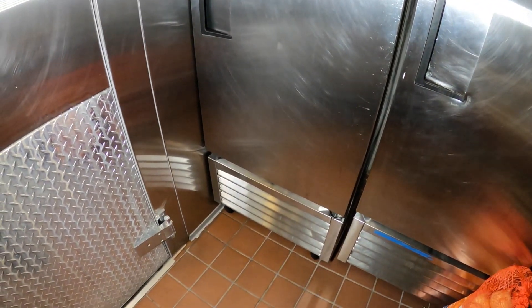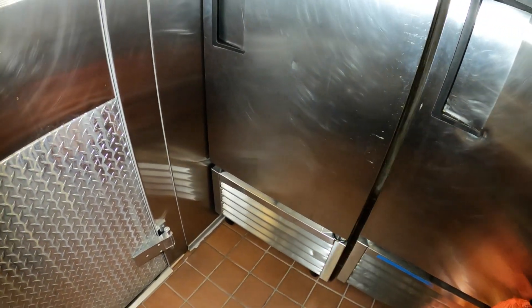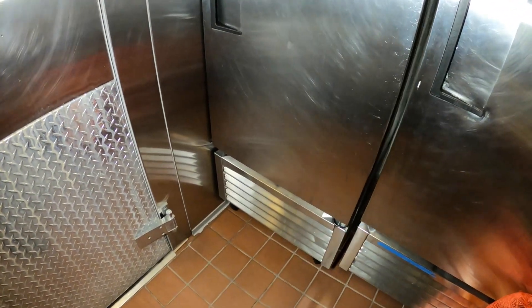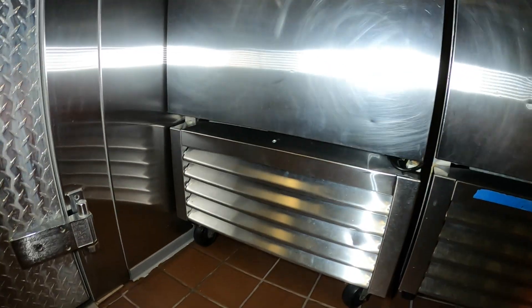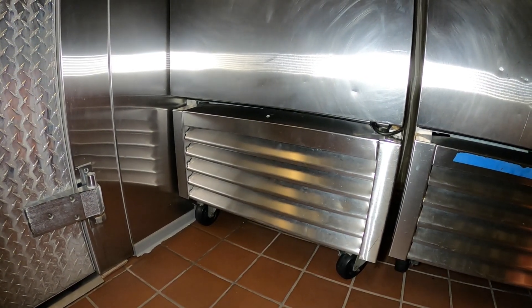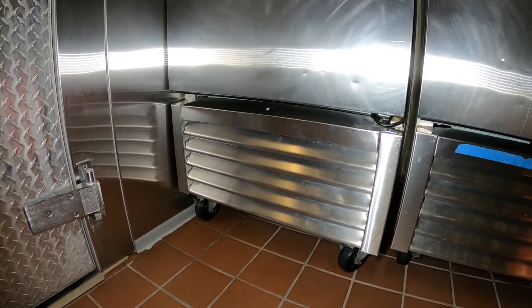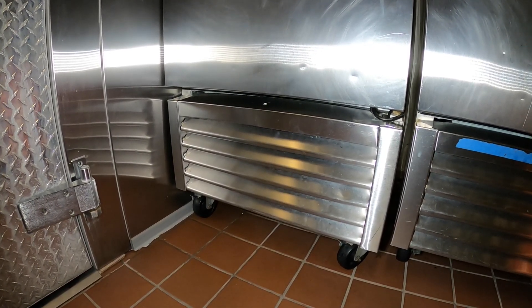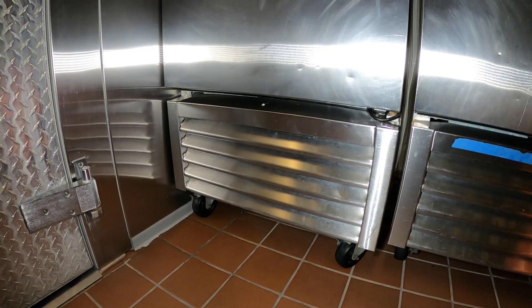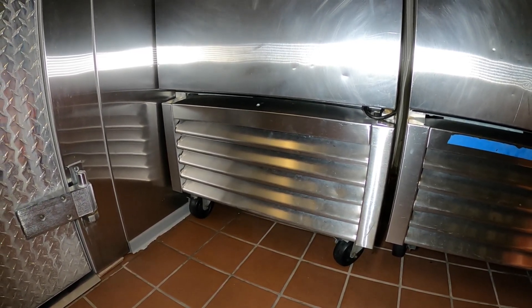What I did was I installed a piercing valve — I do have a video on how to install those and will leave a link in the description. I installed that and found the system was low on refrigerant, almost running in a vacuum. This is refrigerant 404A. While we were looking at that, I saw a bunch of oil stains, and the leak was visible by ear. So this must have just happened and I totally caught it.